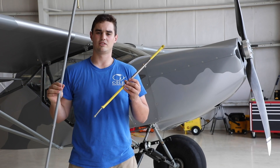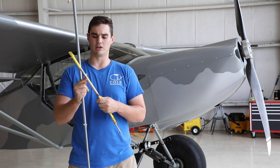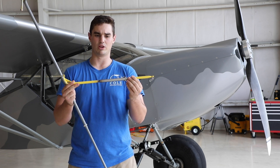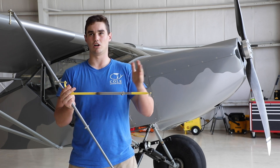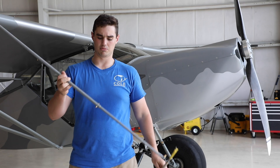This transport kit has brought me a lot of grief, but it ended up working out great. I did mention that I customized this — basically I took it to a friend that has a fab shop and welded on a sleeve that allows this to slide, because the STI wing is too long for this kit. The standard wing is two inches shorter — not too long of a wingspan, I mean too long of a chord. So that was modified properly. Drilled some holes to lock them in place, as well as the side.